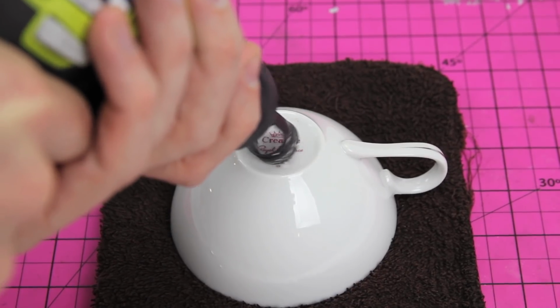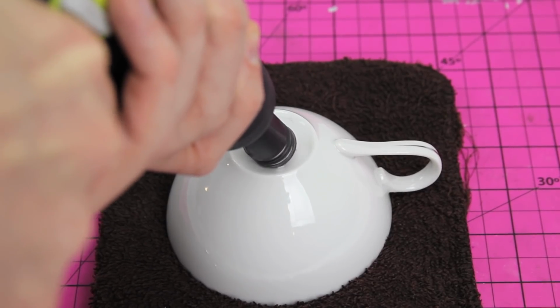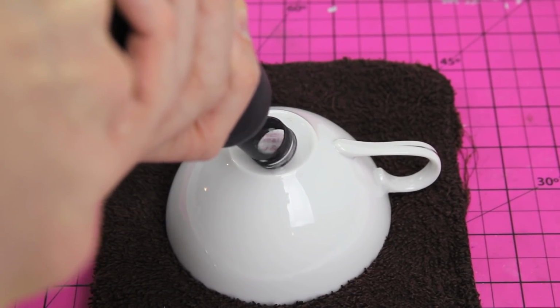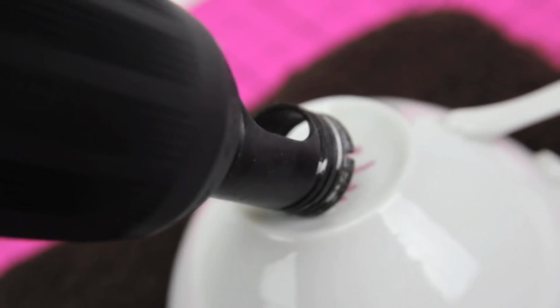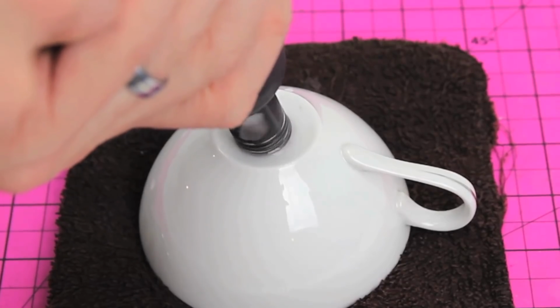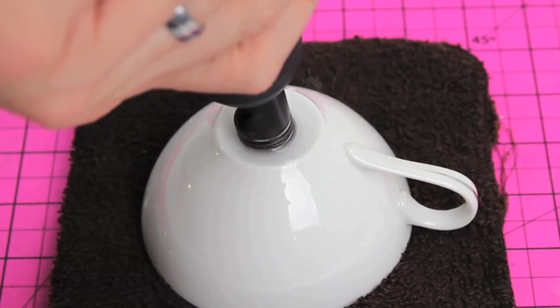And with the drill bit at an angle, you're going to create a small groove on the bottom. It'll take a second of it sliding around a bit to grab on, so give it a moment to catch while adding a small amount of pressure. It'll look something like this. Now the motion you'll want to follow is that of going from drilling at an angle to drilling straight down. Again, just take it slow and remember to apply a small to medium amount of pressure. You'll feel what's right and what's working.